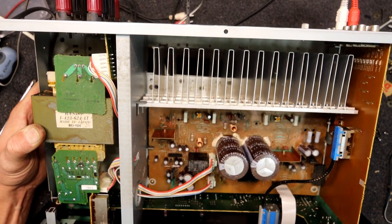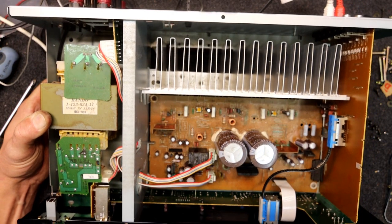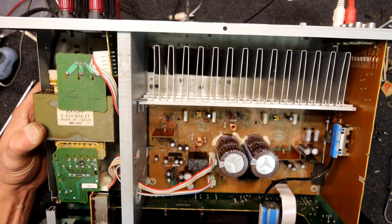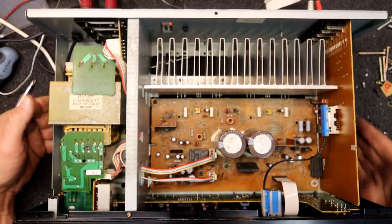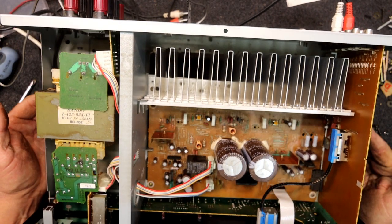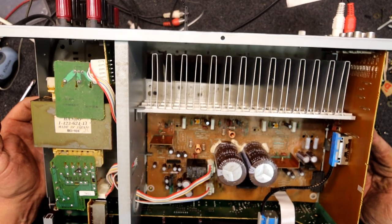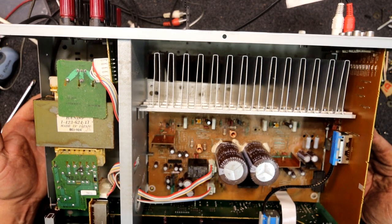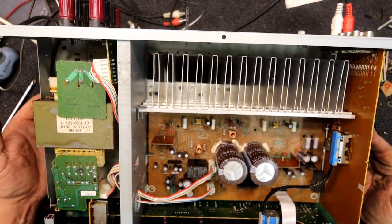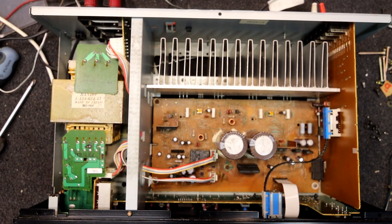These resistors with green on them might just clean off the surface, but I'd prefer to replace them. Thankfully all the little diodes and stuff look pretty good, but it's possible one of those is also faulty — they're tiny, and it doesn't take much for something to soak in. If they've been sitting long enough in water, the corrosion on the leads can work up inside the actual device and cause a dodgy junction. Anyway, we'll get back onto this and see what it does.